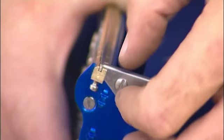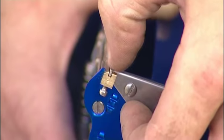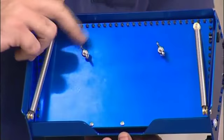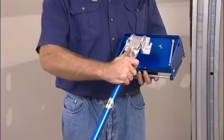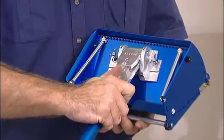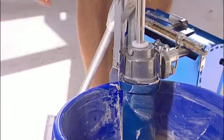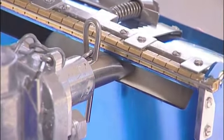The blades should be set 1 to 1.5mm above the skids. Adjust this height using the 2 screws in the blade holder and check that the wheels spin freely. Attach a flat box handle by loosening the wing nuts on the lid and sliding on the handle connector plate. Load the flat box by hand or by using a loading pump with flat box filler. Ensure the compound is distributed evenly.